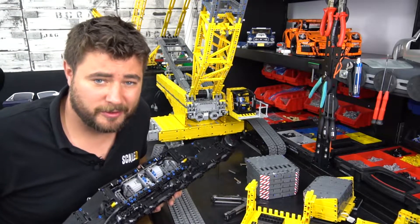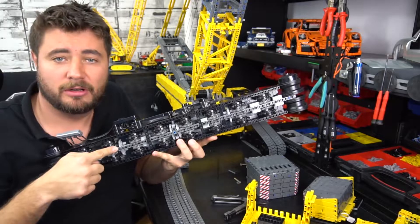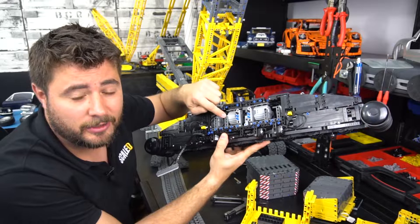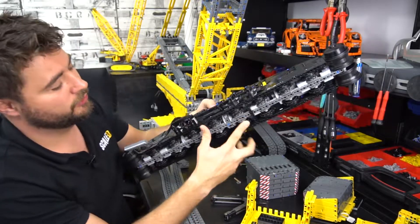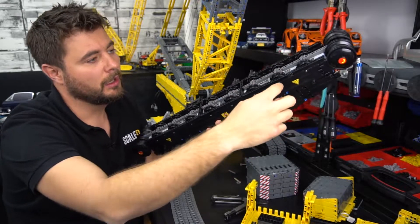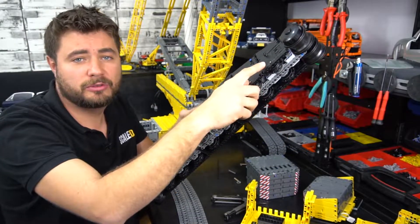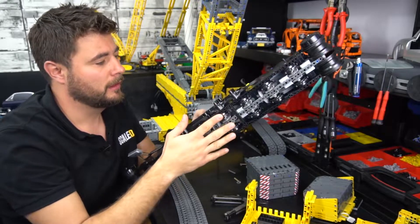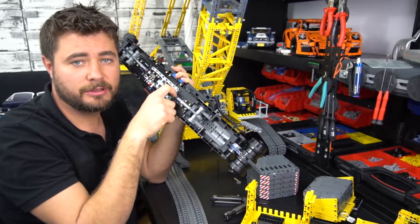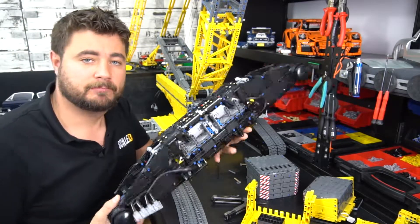Because of the weight of the crane I couldn't have the drive on the outer wheels like on the real crane, so I opted to have it on the inner wheels. Each motor is geared down 240-to-1 and drives two sets of wheels — so this is one motor, another one, another one, and another one. The gears are worm-driven and I had to use metal axles again because of the weight of the crane. On the top part I have two small tensioners so I can adjust the tension on the tracks, and this is just a guide so that the crawlers slide easily. That's about all.